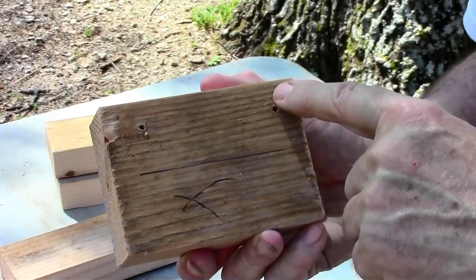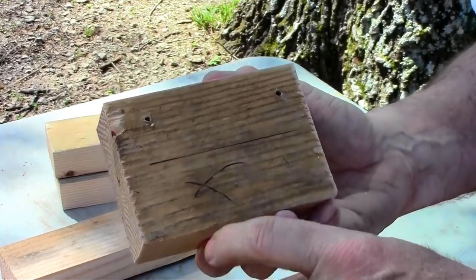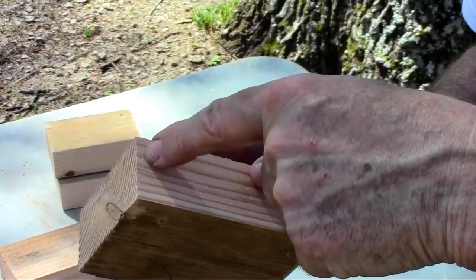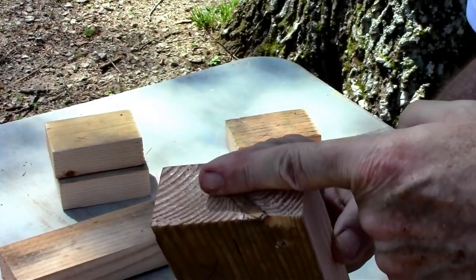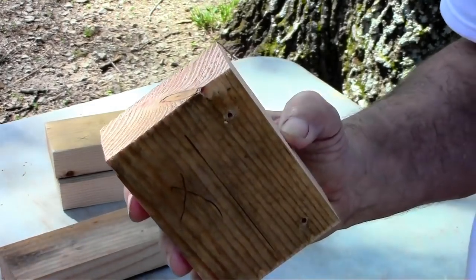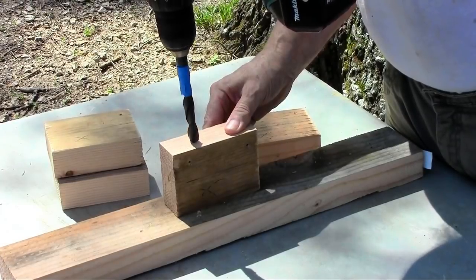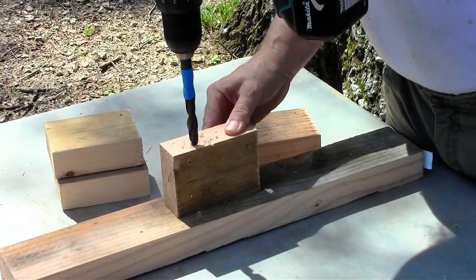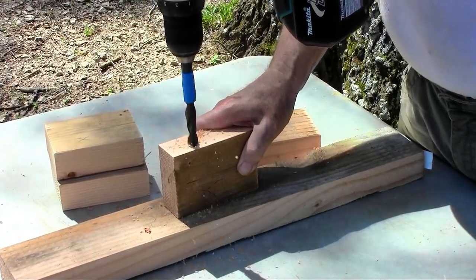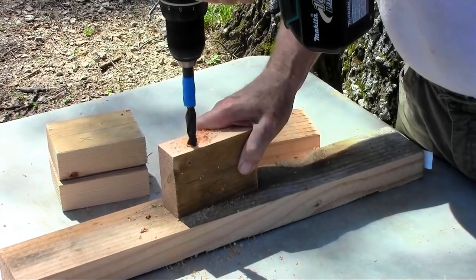Here are our pre-drilled holes, and this area here is going to be the open spot in the middle. I made a little X where I'm going to drill the half-inch holes into the wood, and then into the wood the other way like an L — a little 90-degree turn. This is the half-inch drill bit and I'm going to drill down. I put tape for the depth, so I'll just drill down through the two-by-four until I get to that blue tape.